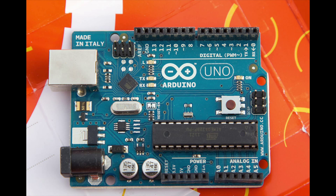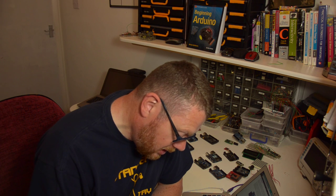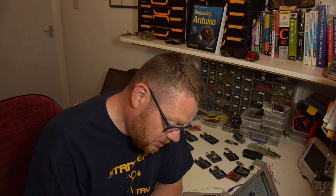What is on an Arduino board? The board itself consists of the main chip, which runs along just below the middle — this is an ATmega328P chip. That's the brains of the Arduino; this is where you will upload your code to. This chip will run your code and talk to the sensors and other components you've connected to your Arduino board. The chip has output pins and input pins, and these are broken out onto the board along what are known as headers — basically sockets where you can connect wires or directly connect devices.